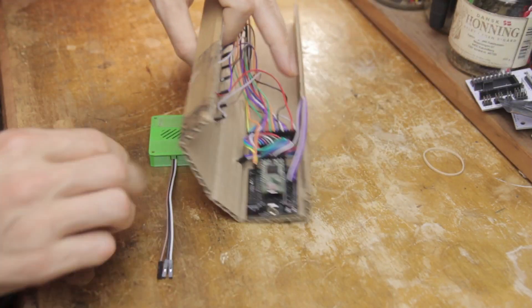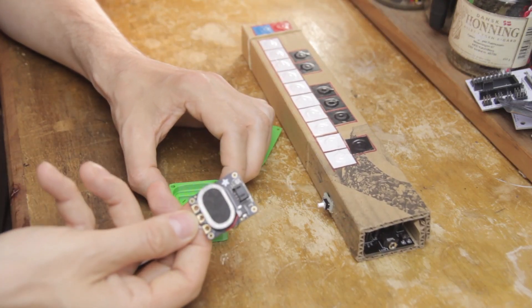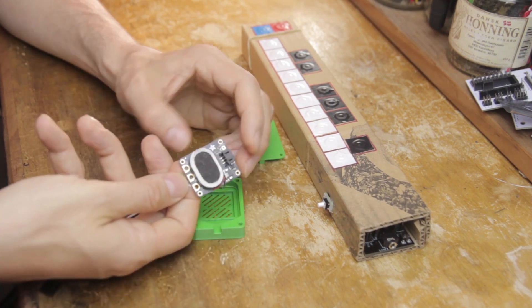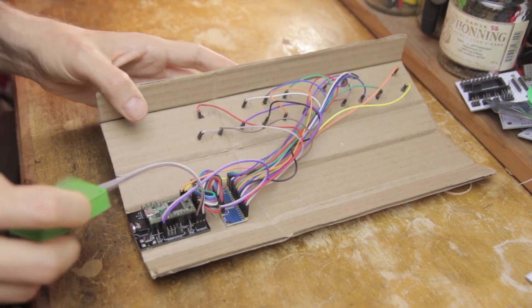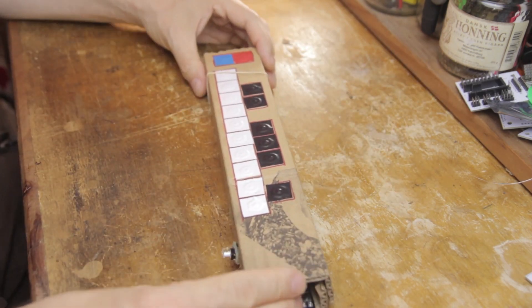The other audio output provides power as well as sound, and so it comes out through this triple header rather than an audio socket. I'm still trying out different things on this output, and currently I'm running a Stemma amplifier and speaker set from Adafruit. It doesn't provide a lot of loudness and it's not super high audio quality, but on the other hand it's so tiny that I'm able to actually fit it inside any one of the instruments, even with this little 3D printed case that I made for it. So that's super cool. I'm also experimenting with a homegrown LM386-based amplifier, which will hopefully work both for high-end headphones as well as small speakers. I'll get back to that in future videos.